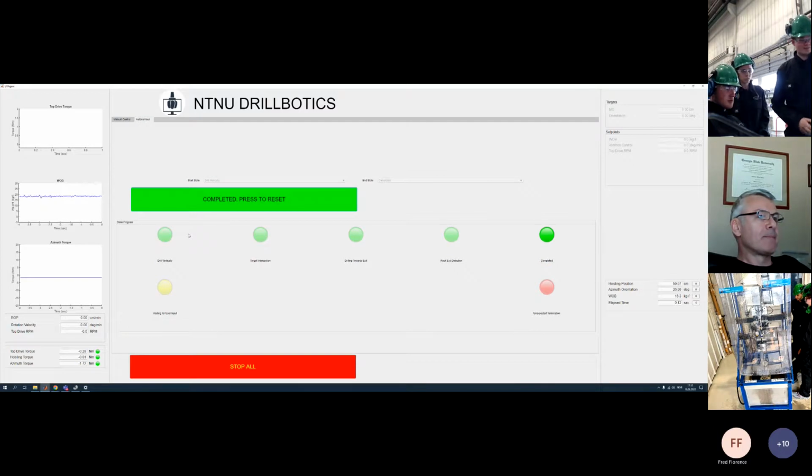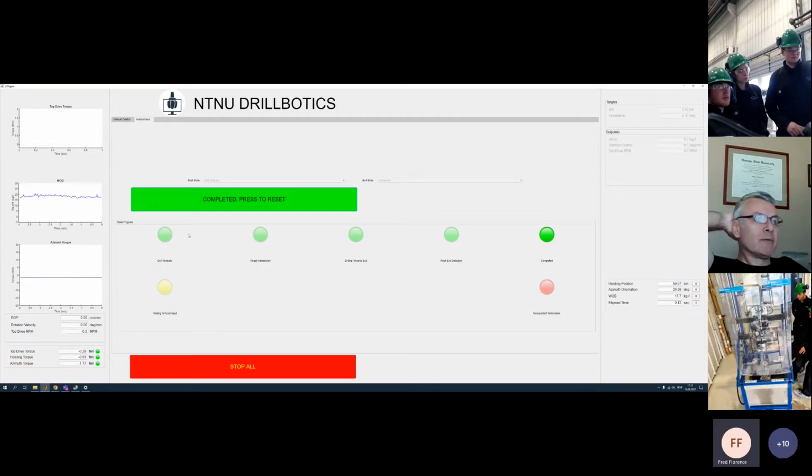Only one click on. But this state determination, is this based on measured depth compared to the planned well path? Yeah, drill vertical is determined based on 10 centimeters or 4 inches. So that is the first state. And then it goes towards intersecting the targets. But you're really comparing measured depth to your planned depths for these different events? Okay, great. That's perfect. Yes. Okay.